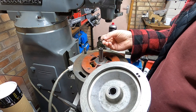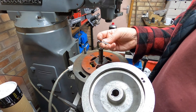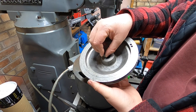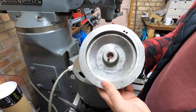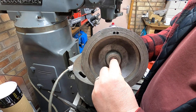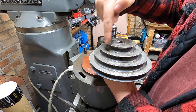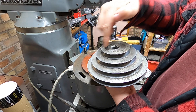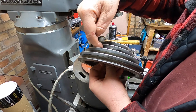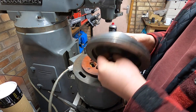So I'm going to put the key in the opposite way around so it doesn't line up with the hole on that dint in the hole. Instead of having one hole, I'm going to turn it into three. I'm going to divide this up into three, mark it all out, and then drill through on the same pulley, and see if we can tighten it up that way.